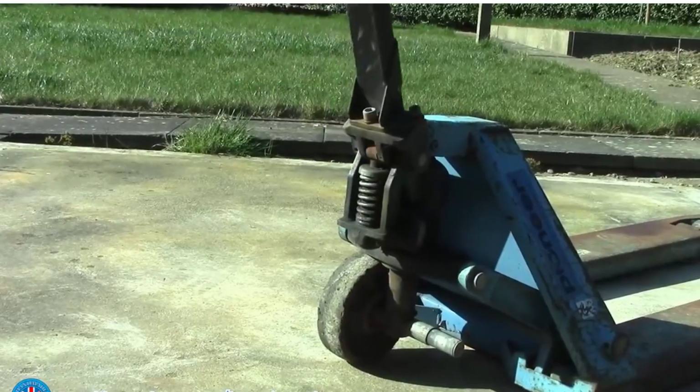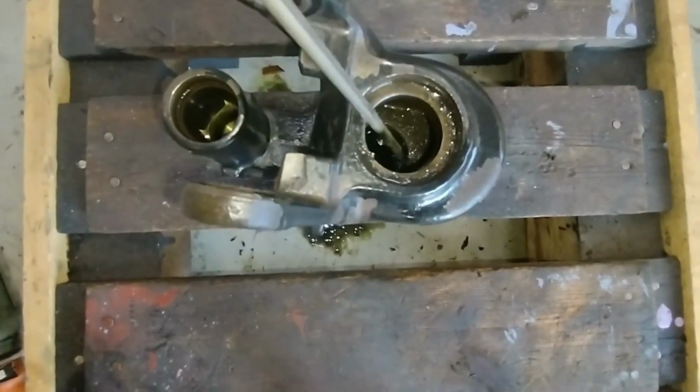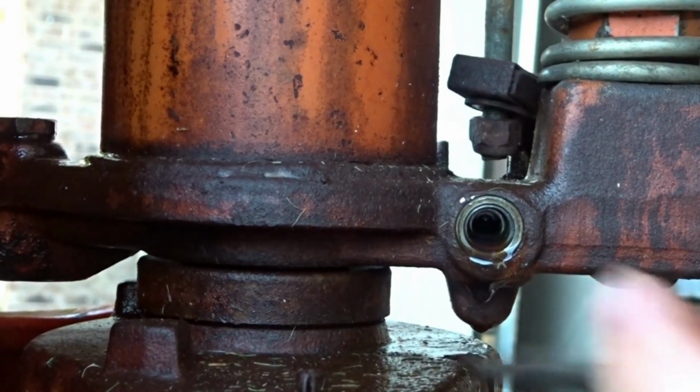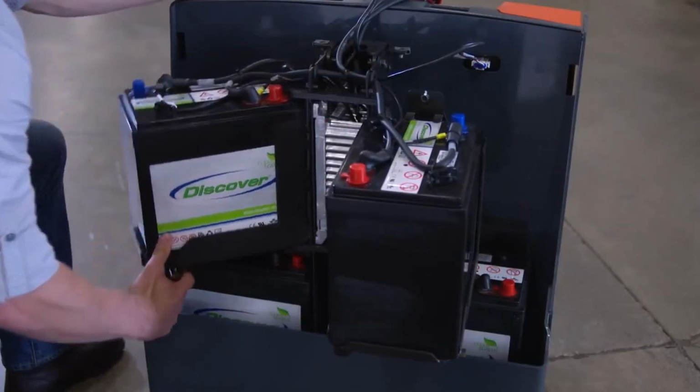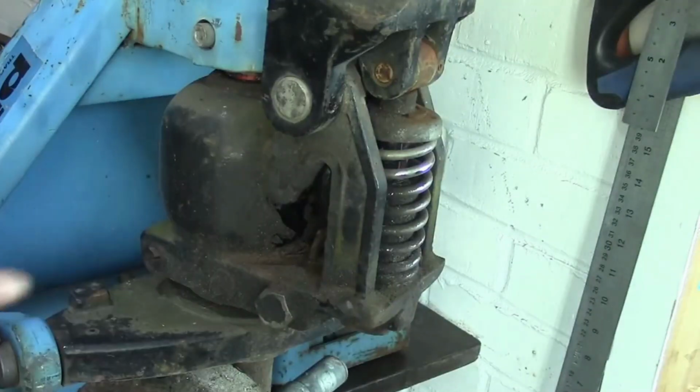The first step in solving any problem is identifying the issues causing it. Here are some common reasons why your pallet jack might not be lifting properly: low hydraulic fluid, air in the hydraulic system, damaged and worn out O-rings, leaky hydraulic pump, battery or power issues for electric pallet jacks, debris, and mechanical deterioration.